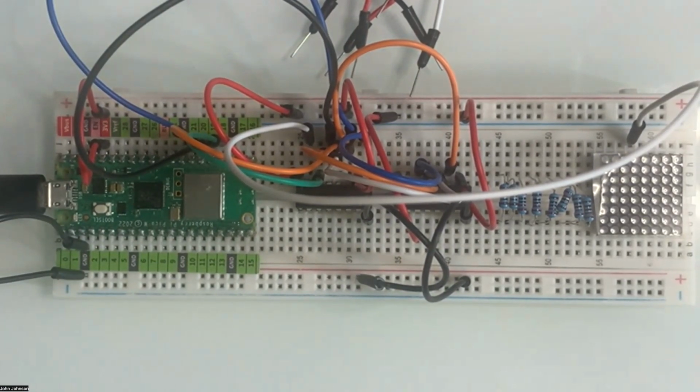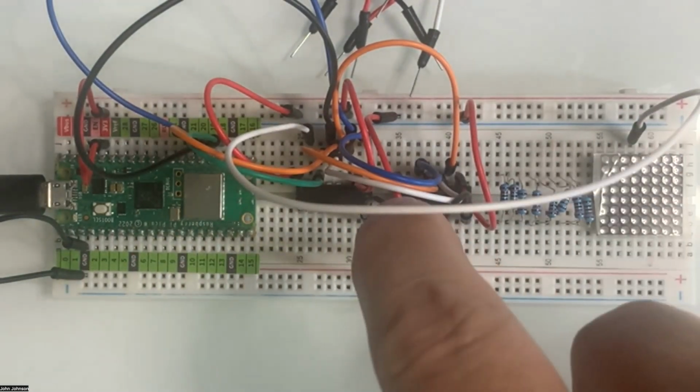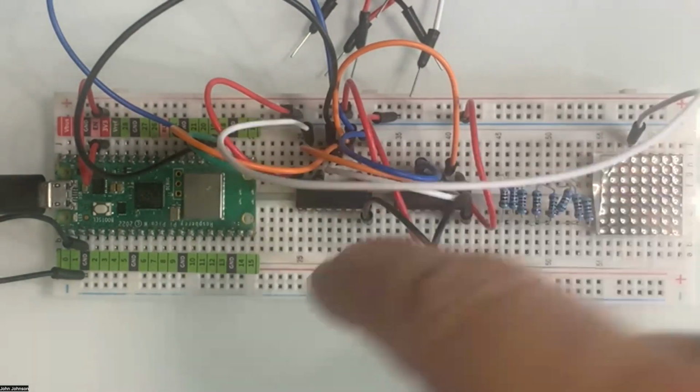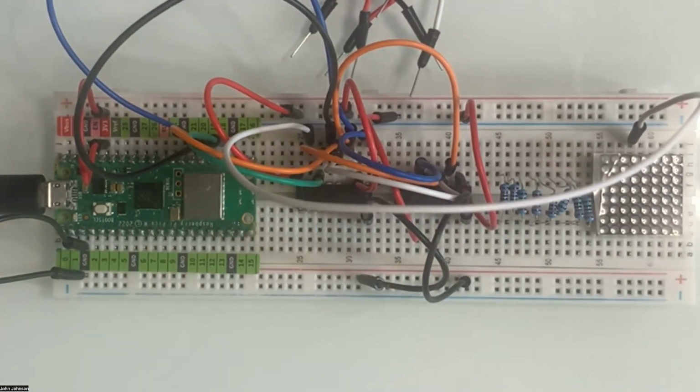All right. We'll go with this. And now that we've got those nasty things in, let's start hooking up. Let's see. I just want to make sure that we've got everything on the second IC chip connected here. We did our inputs. Nope, we've got one more that we have to run out. So remember we took this white one over here and we ran it over there. By the same token, we've got to take one pin over here, which I think is pin 15. It's like the odd data one on this side. The data is all on the bottom side, except for that one, 15, on the top.